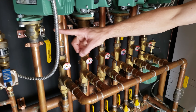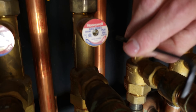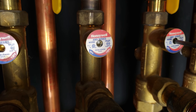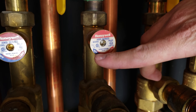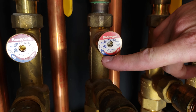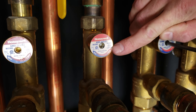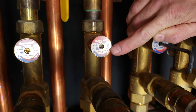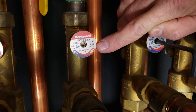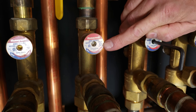You can see an Allen wrench right here, which is used to adjust the temperature of the water allowed through this mixing valve. You can set a mixing valve anywhere from 90 to 130 degrees. These particular ones are set for about 115 degrees because they're feeding hot water radiant tubing. That tubing is touching the wood inside this building in order to transfer the heat.